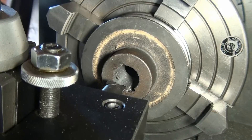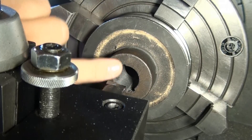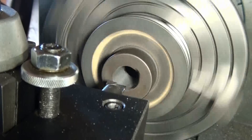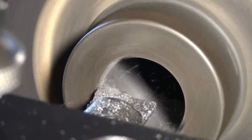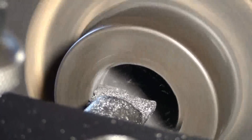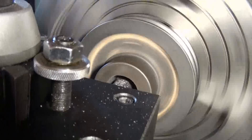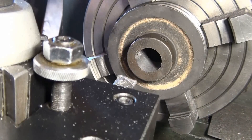In the next part of the video I'll be doing a demonstration. In order to broach this pulley, I first need to cut a one-inch diameter into the existing pulley — I've got sixty-one thousandths more to go before I get to my one-inch diameter.